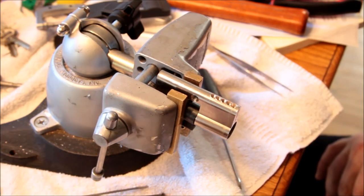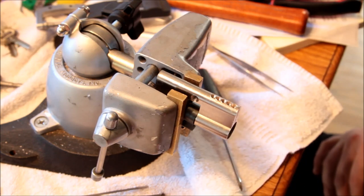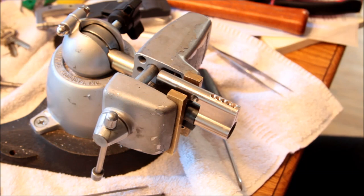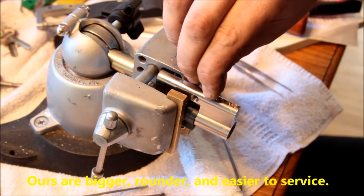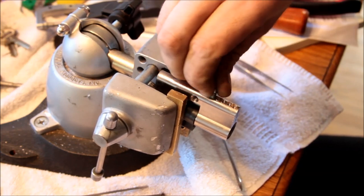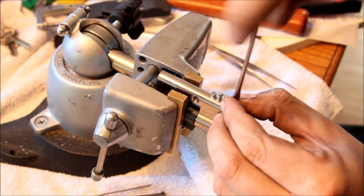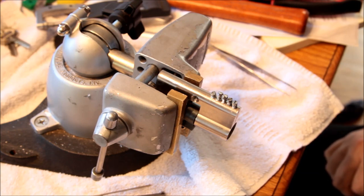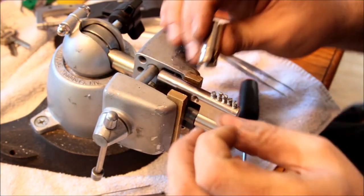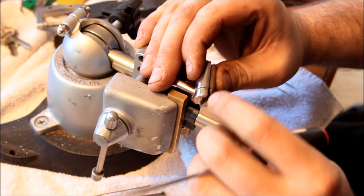What I did was I went through and tapped the chambers - on this Euro it happened to fit a 6-32 tap just perfectly. American locks, from what I've read, want size 8-32 screws. I didn't have the proper blank screws but I made some little ones out of other screws I have. When I reassemble the lock I'll put these back in - we'll have to shorten them a little bit, but that's a cool tip. Getting that thing apart was a bloody disaster. I think the top pins were getting jammed in that clever little notch, so I needed to have the plug turned more than I did - lesson learned.